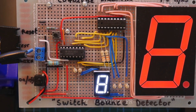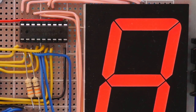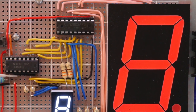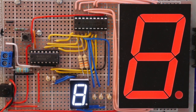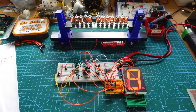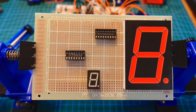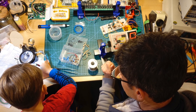With the counter chip and little LED display working, I thought it would be fun to put in one of these really large displays. To do that you need a little bit more current, so I've got a second chip — a Darlington driver — that amplifies up the current so you can drive the bigger display. Once that was all sorted and working, I did my usual thing of moving to a bit of pad board or strip board, and putting the chips and resistors on the circuit and wiring them together a bit at a time, making it work one bit at a time so that by the end the whole thing should be working.